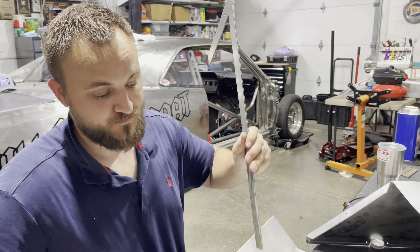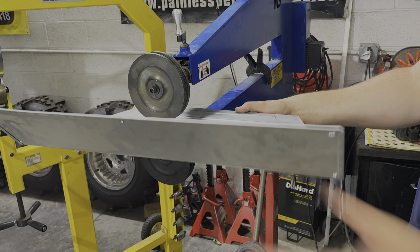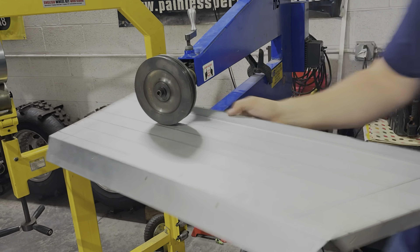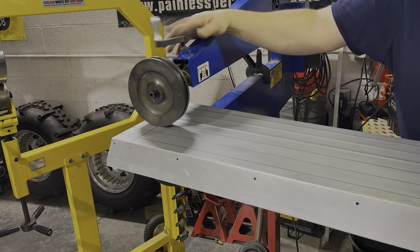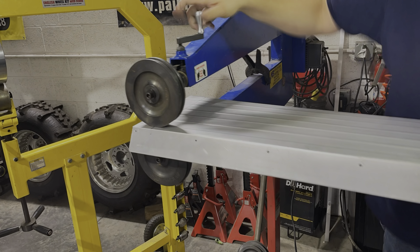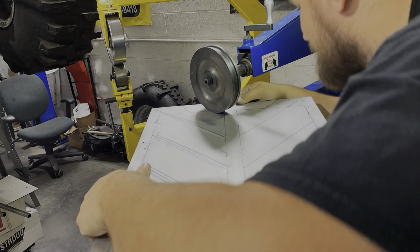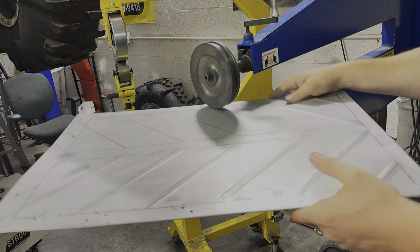Alright guys, we'll get this deal lined out and start bead rolling here very soon. It's time to hold on to your beard hair and hammer down. I've got my headlamp on so this old feller can see what's going on on these bead roll marks. It's just repetition, repetition, repetition — consistency in making these lines straight and parallel. You've got to really keep an eye on these straight lines; a straight-line bead-rolled panel will really show off any mistakes you've made if the panel's not square, if the cut lines or bends are off.